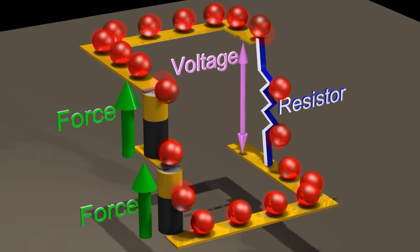The way that we reduce the amount of power that goes to the motors is with a series of resistor grids, and they reduce the amount of power that gets to those motors. The blue resistor portion of this animation represents the resistor grid that would be mounted under the car. When we're in first point, that resistor section would be very long, really limiting the power that's able to get from the pole to the motors.